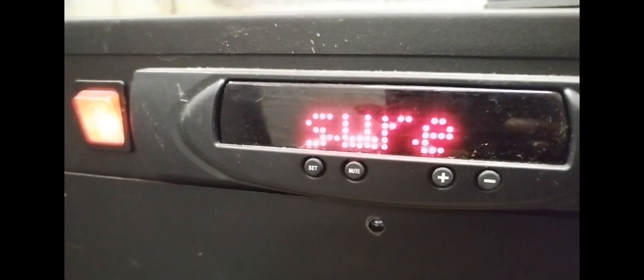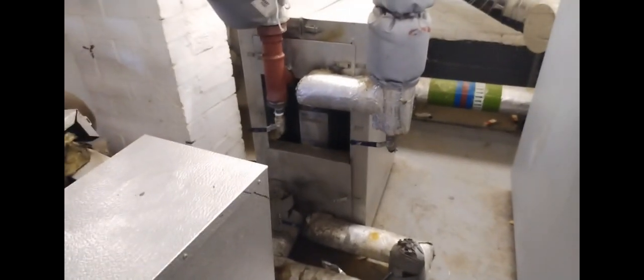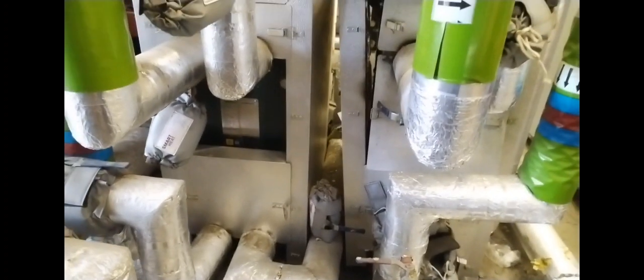On this, you have two pumps on a pressurization unit that have failed and need replacing. Not sure how familiar you are with these Flamco units, how to operate them. There are two Flamco units on this system because you've got plate to plate heat exchangers. So you have one on one side and one on the other side of the plate. One's on the boiler side, one is on the client side.